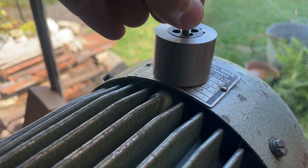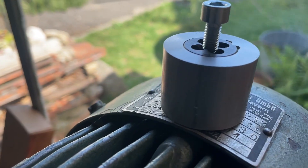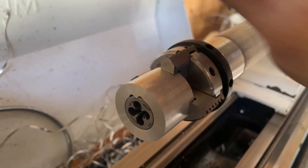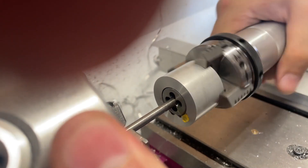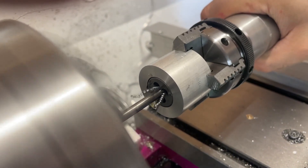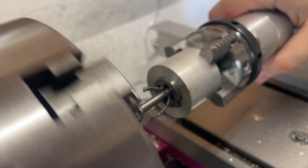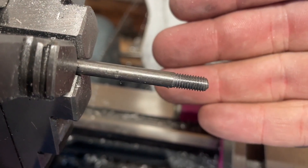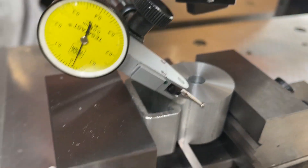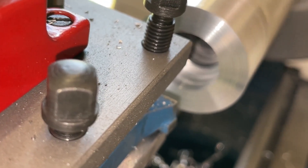There's that little groove on top, and when I put the die in you can see it will not turn by itself. Then I can put it into the four-jaw chuck — that's why I put a thread in there — so you just thread it on a bit, turn the machine on, and you can let go with your hand once there's enough thread cut or when you reach the shoulder, at which point it will just spin in your hand and you can reverse out.